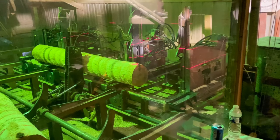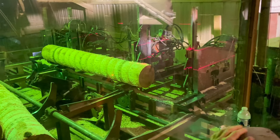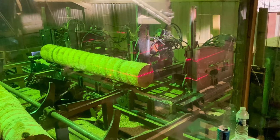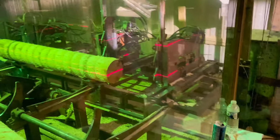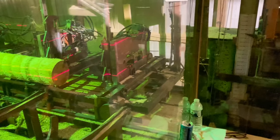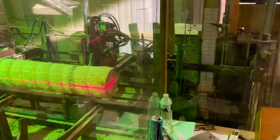It's 12 inches, so what I'm going to do is take an inch off each side to make it 10 inches. I'm trying to get as much of this to turn into cants as I can. I'm going to take an inch off each side, give or take, and also take a batten strip within that inch.